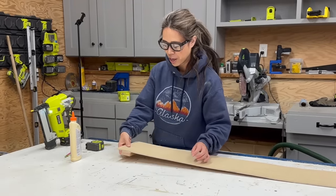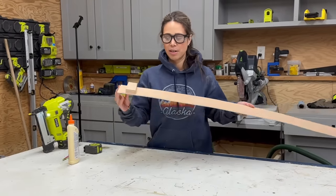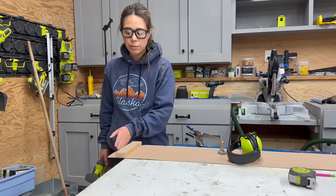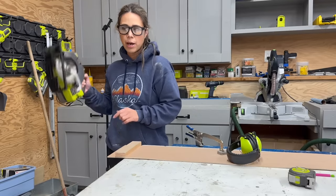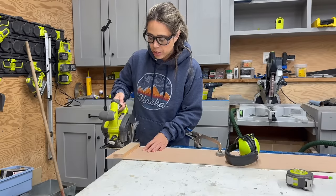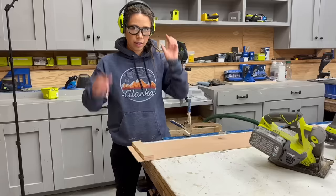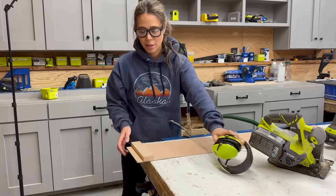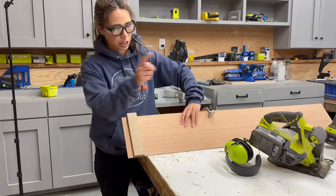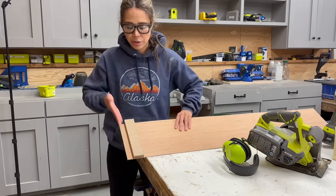I lied — it was actually a stapler, but a brad nailer would work too. So it'll look like this, a masterpiece. The next step is I want to trim this outer edge to match the foot on my circular saw, so I'm going to just cut this off with the board clamped. So this is now cut, and this space here matches my circular saw and I've got a perfect guide to run my circular saw blade down.